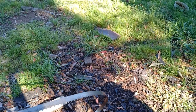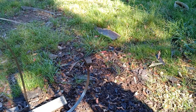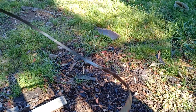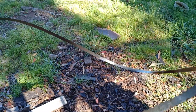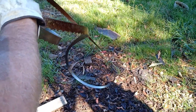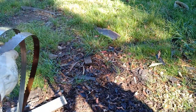A little bit of a trick to folding these 5.5 meter long razor blades up. That's the way I do it. Hold it, teeth up, your thumbs on the top of your teeth, roll your thumbs inwards, twisting the blade, and there we have it. A bit hard to explain, you just sort of do it. Took me a while to learn it too.